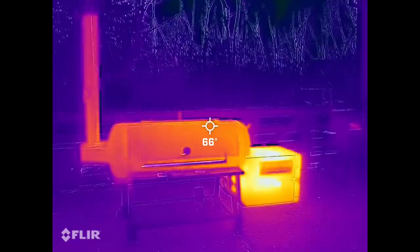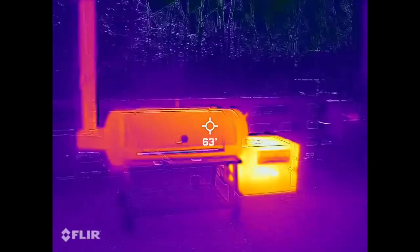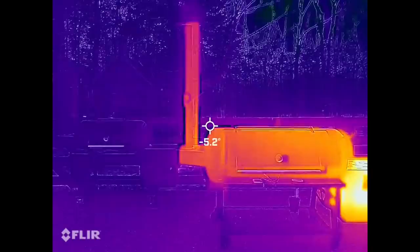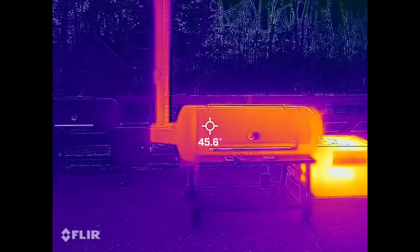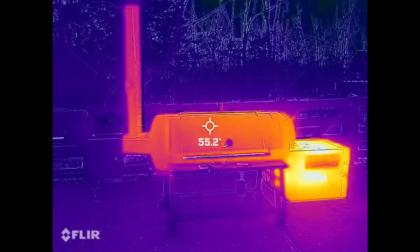Here's my attempt to film with the thermal camera — I never film, so it's not perfect. You can obviously see that the firebox is much warmer, and then a slow gradation from the right side to the left where it gets a little cooler. And then as it moves up the stack, you see that the temperature goes down even a little bit more. So kind of exactly what we would expect. There are no hot spots or cold spots, except maybe right in the center on the left side there may be a little bit of a cold spot. I don't know if that's just some kind of artifact of something on the surface, but we see some clear differences.